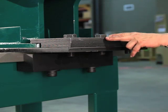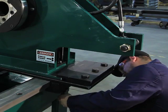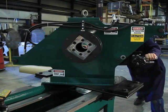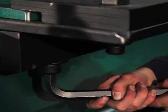Choose the disengaged position whenever using the nut runner. The locking clamps at either side of the NTS 50 allow it to turn between the loosening and tightening positions. To change positions, loosen the bolts holding the locking clamps and turn the NTS 50. When it is square with the carriage, retighten the locking clamp bolts.